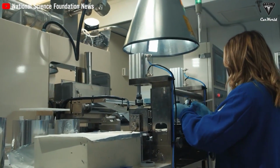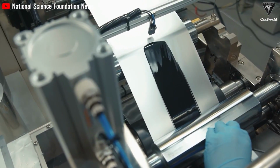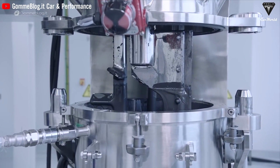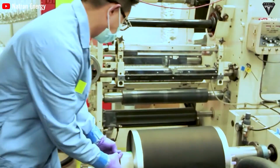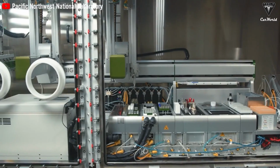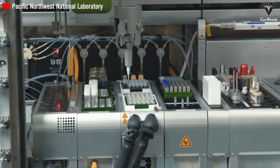Silicon, despite its high energy density, encounters issues with volumetric expansion during battery cycles, and that makes it challenging to get that long-term performance. This patent proposes a multi-layer approach, with a silicon-rich layer in the middle and higher adhesion layers on the top and bottom to maintain the stability of the active electrode structure, and that improves connectivity and minimizes separation inside the battery.